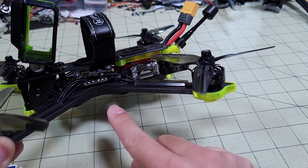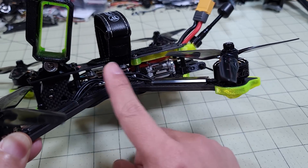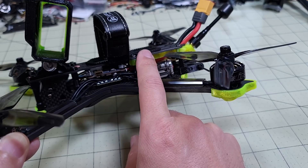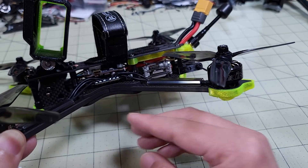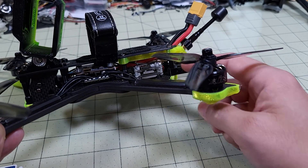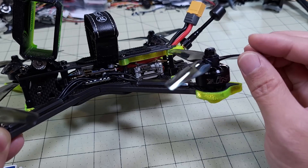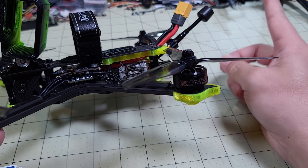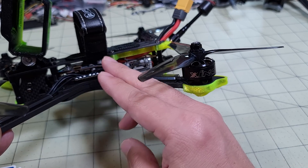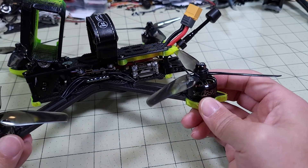Five millimeter arms. The sandwich plates are three millimeters now instead of two millimeters. The version I got here is an early version, so this top plate is still two millimeters, but all plates are supposed to go from two to three millimeters. The standoff height between the top and bottom plate is now 28 millimeters instead of 32 or 33 millimeters on the analog version, bringing the CG down so the battery lies more in line with the props for better CG feel.